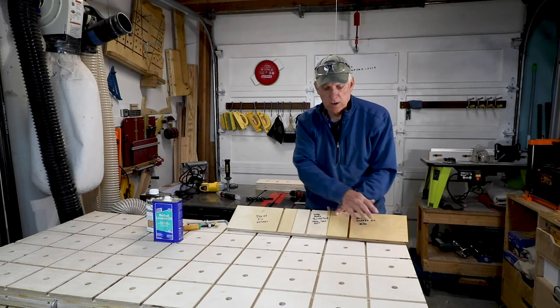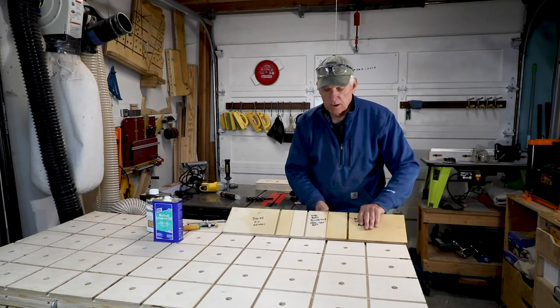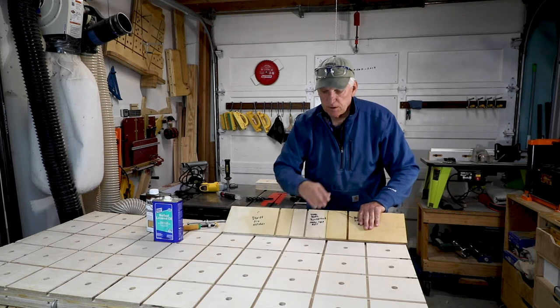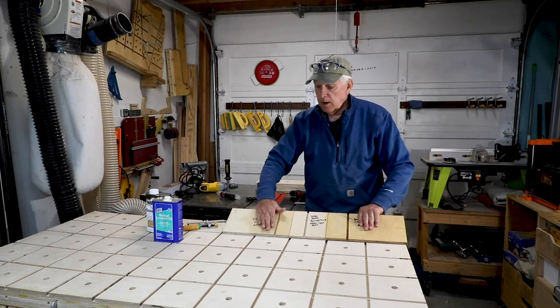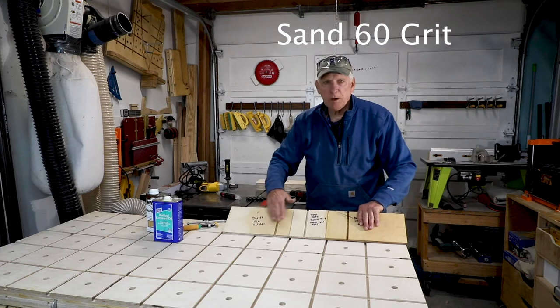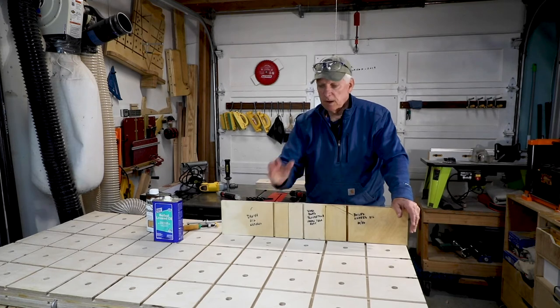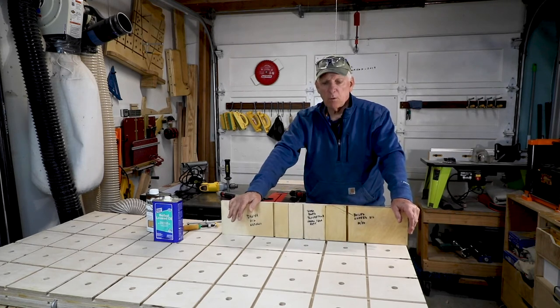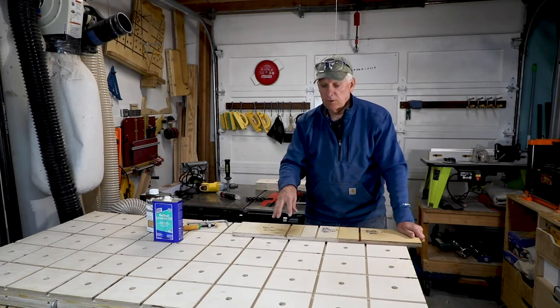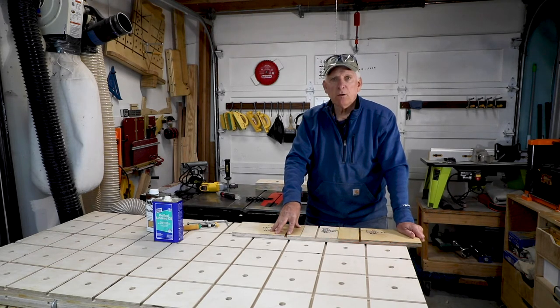So just decide which look you like best. This surface is a little rougher. Workbench tops are not supposed to have things sliding around a lot, so I'm going to use the Danish oil — but then I'm going to sand the very top when I'm through to rough it up a little bit so things don't slide too much. That is the Small Workshop Guys test of what I'm going to use in the future for my match fit dovetail clamp jigs of various types.